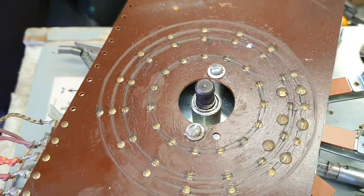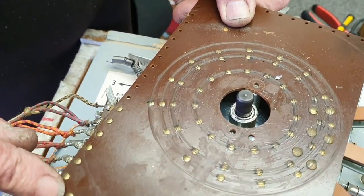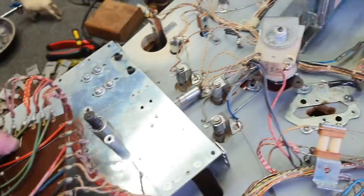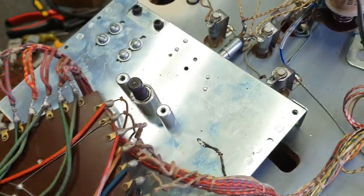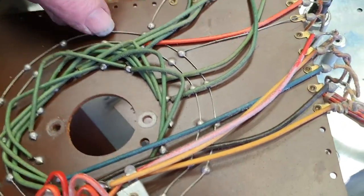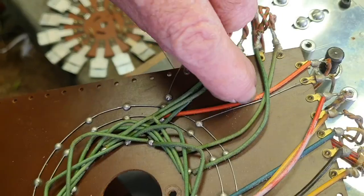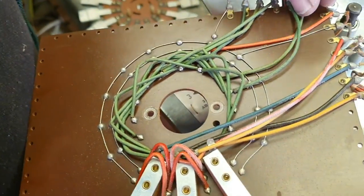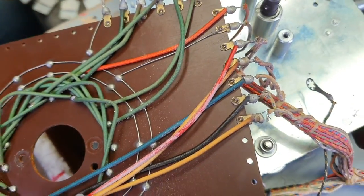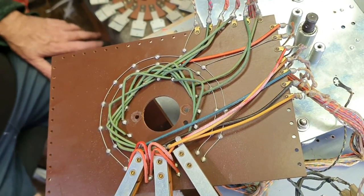Now all we need to do is take these two screws off here. With those two screws removed, we can now lift that contact plate off. Just a point of interest here — there's a bit of wire broken, a bit of solder. What we always do when we put these back together, we like to get a meter and check the continuity, especially of all these wire linkages. We've actually had them break off, and it can give you a bit of grief because it makes continuity through the back of the unit. Sometimes they look like they're good, but they're not. We actually had one broken right off on the edge — and it appeared to be there. That was actually not on a rototarget, but it was on a player unit.